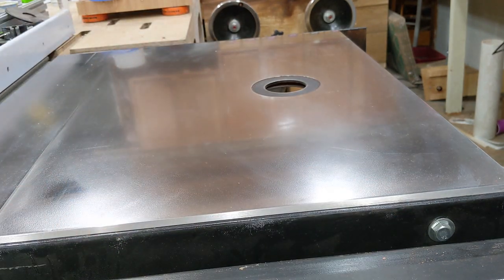However, there is a downside to the polished surface. It scratches easily and since there's no protection on it, whatever drips onto the surface probably will not come off completely, even if you get to it pretty soon. Scratches will give rust a place to grab hold, and since glue is water-based, I'm not real excited about the glue drips either. So it looks like I'm going to be treating the polished portion of my table saw anyway.